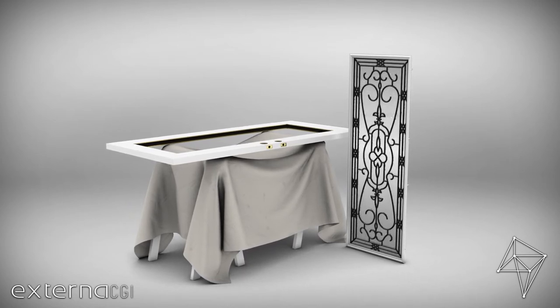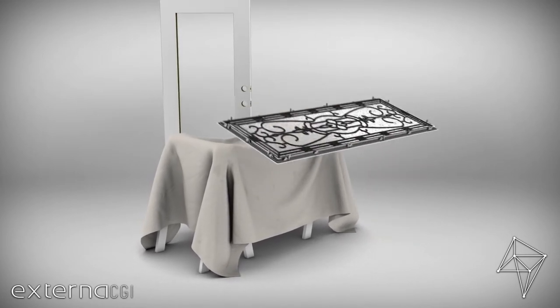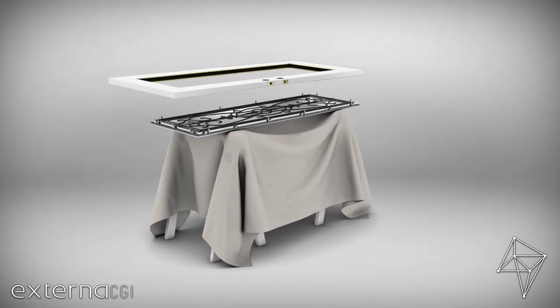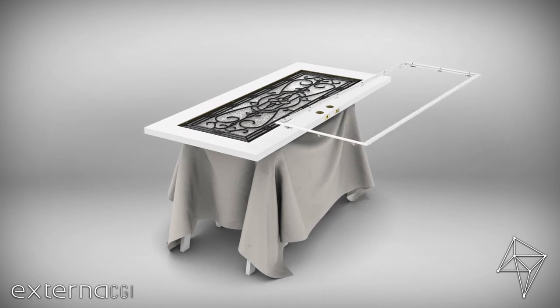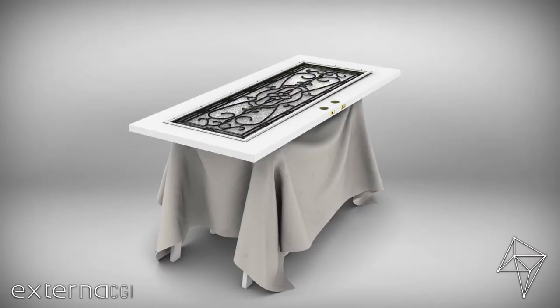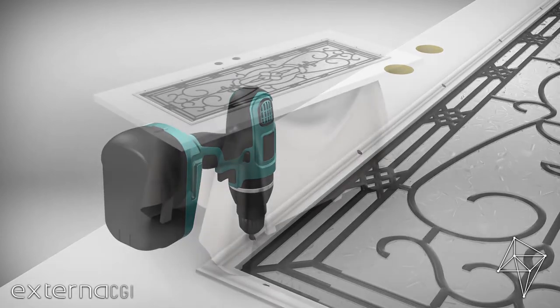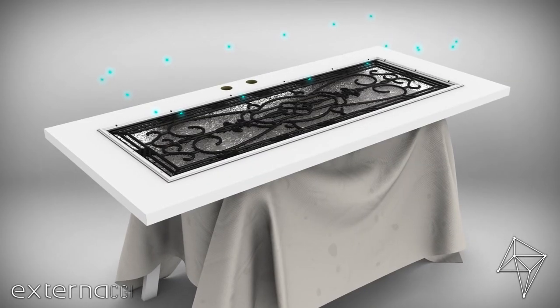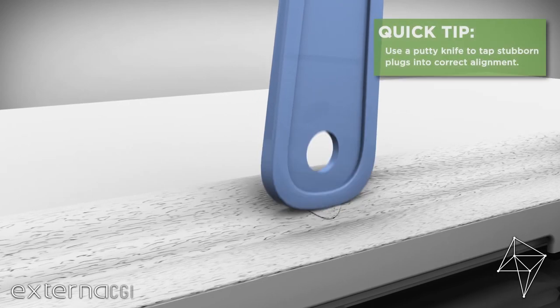You are now ready to install your new ODL door glass. Lift the door off of the sawhorses and lay the outside door glass frame out over the sawhorses. To ensure the glass is installed correctly, the temper stamp should appear on the bottom of the door. Carefully lay the door down over the door glass. To properly distribute the weight, place the bottom edge of the door opening snugly to the bottom of the door glass. The screw hole side of your frame should be installed on the inside of your door. Place the new frame into position by matching the screw hole guides. Insert each screw working from side to side, tightening firmly so that the frame fits snugly against the door and the seal is compressed. However, avoid over-tightening. Align the screw plugs with the frame profile and insert and tap each one into place.